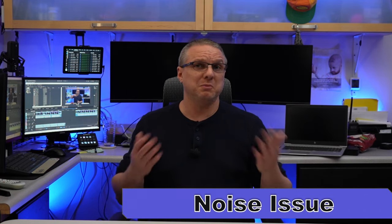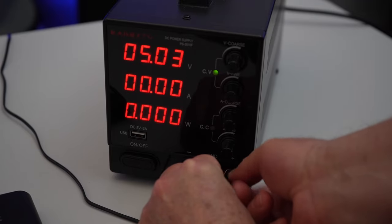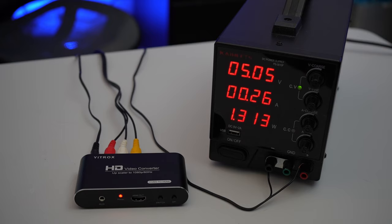As for the noise issue, this problem really bugged me, mainly because it seemed to affect all of the more expensive upscaler devices, and it made me think they all just shipped junk power supplies — which they did. I found that units that came with a USB power cable and I plugged into my PC USB port did not have the line noise. This made me think a better power supply would remove the noise. To test that theory, I created a power cord from an old adapter hooked up to my bench power supply, and when I did this the noise went away. I found a 5-volt adapter that produces clean power on Amazon — it's only $15 — so just plan on buying this additional power supply when you get one of the upscalers.